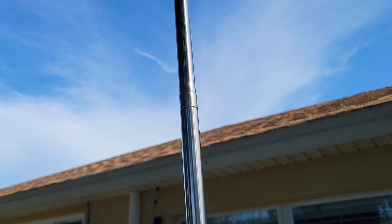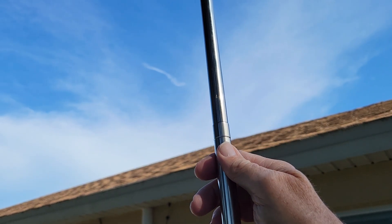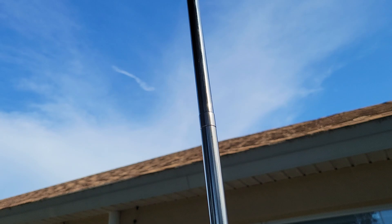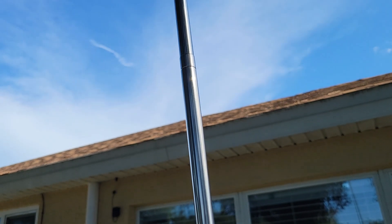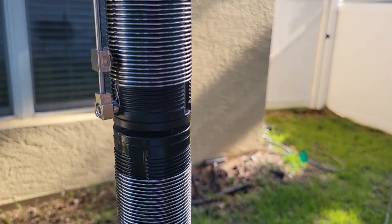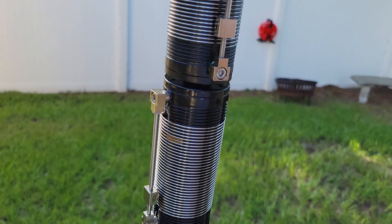After taking off one link and adding the second coil and extending this all the way, I find myself bringing it down a little bit more. This is, I think, 18.3 feet — roughly six meters. And now I'm kind of happy with a 2.2 SWR, not the best.